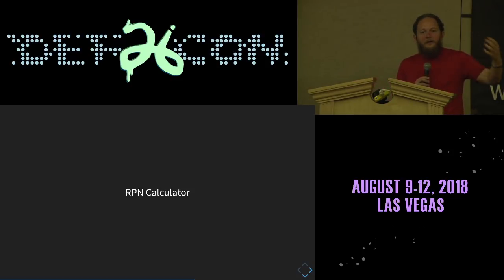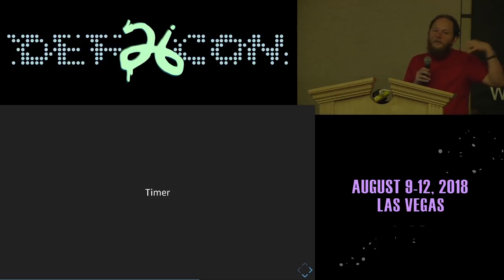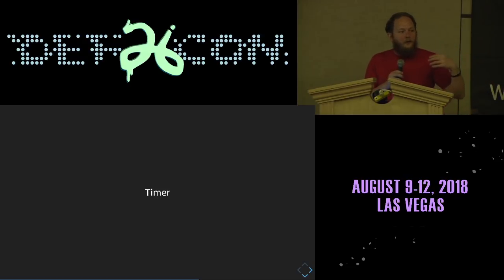I implemented a reverse Polish notation calculator. So like the old Hewlett-Packard calculators, whenever you enter a number, it pushes it onto the stack. Whenever you hit an operator, it pops the last two values off the stack and pushes the result. This allows the calculator to be written quickly and with very small source code. New functions can be added. There's a timer. Each of these applications is written as a small little module of C code so that you can fork any application to add new pieces to it.